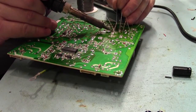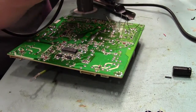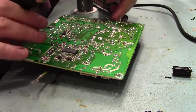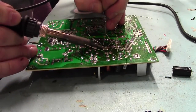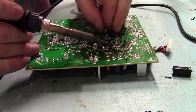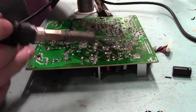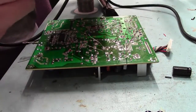Iron on. And we go. So it shows you in the soldering video. Iron on one side, flow the soldering from the opposite side. And one other problem. Electrolytics don't particularly like heat, so don't keep your iron on for too long. You only need it for a few seconds on each cap. As soon as you've got enough solder on there, take it off.